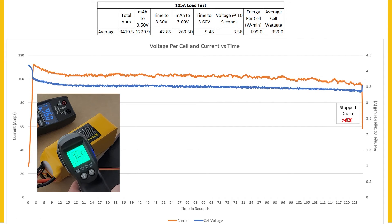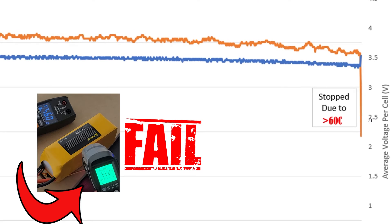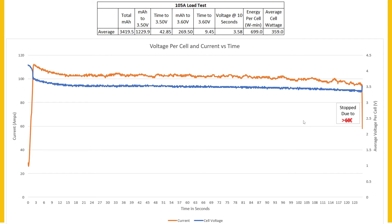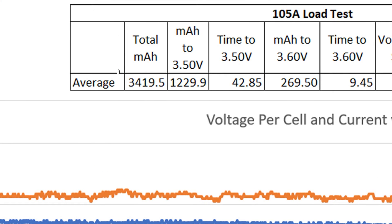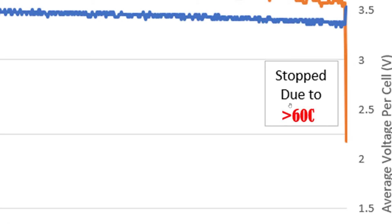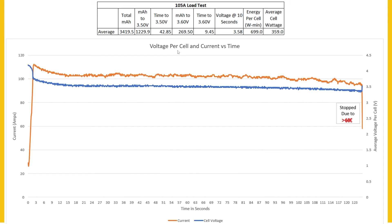The test did have to stop because we exceeded 60 degrees Celsius. I'll show right here where we started to exceed it. What was really interesting is that we measured multiple different locations on the battery and in different locations it was giving different temperature values. Closer to the wires I was getting hotter temperatures and further away from the main leads it was much less. This is important to note for next time because what's happening is I'm blowing through the 60°C mark and probably getting more capacity than what is actually true for that stop point — parts of the battery can actually be 64-65°C when I stop. This is also true of previous tests, and as we continue we'll find better ways to get even more accurate data.